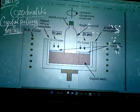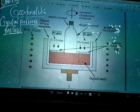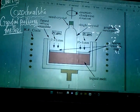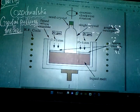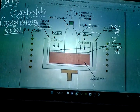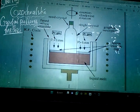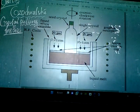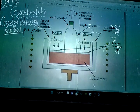In the preparation of semiconductors, first we did distillation and second is zone refining. Whatever material I got from distillation was sent for further purification by zone refining. Now whatever material I got from zone refining is polycrystalline — it is a purified metal, but it is polycrystalline. To behave as or be used as a semiconductor, I need a single crystal. So the material purified by zone refining is sent to the next process: the Czochralski crystal pulling technique, by which I will prepare a single crystal of silicon or germanium.